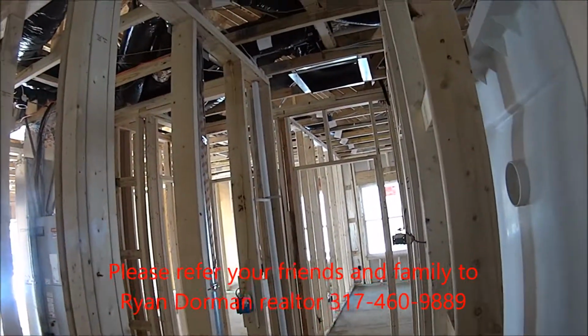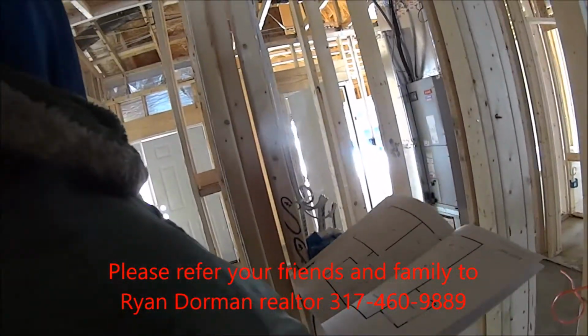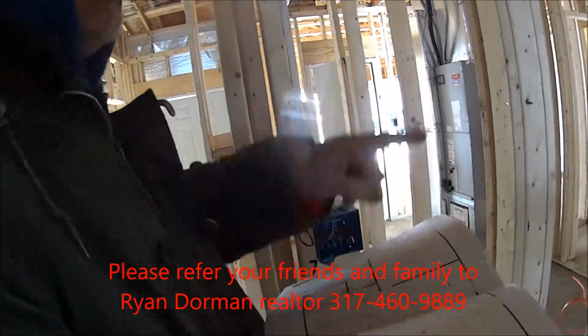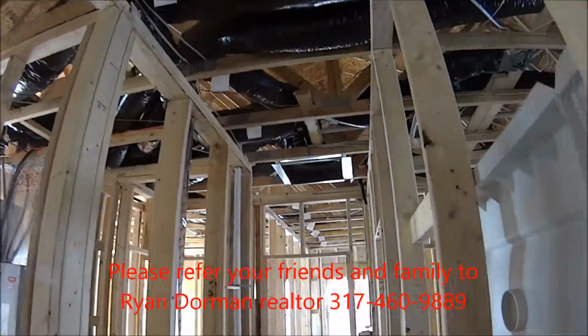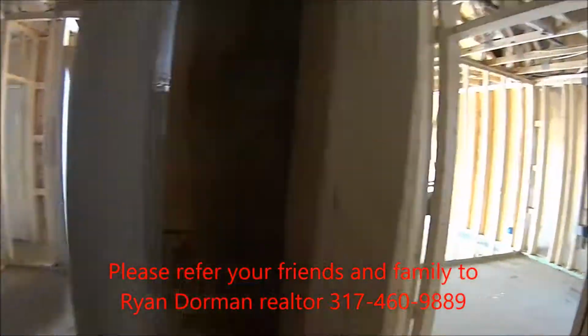As you're coming down the hallway, so the two switches here, again, one of them is a three-way switch for the lights here in your entry. The other one is a three-way switch for the light here in the hallway. And the other side of that three-way switch is right here around the corner.